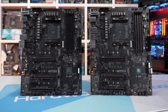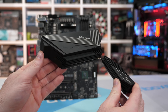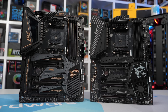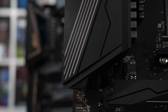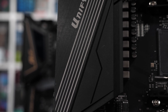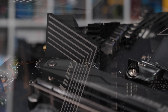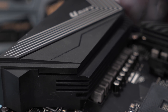The Unify is said to run even cooler than the Ace due to a much larger heatsink. Whereas the Ace features a plastic IO cover that encases quite a bit of the VRM heatsink, the IO cover on the Unify is part of the VRM heatsink itself. MSI has gotten rid of the plastic and the gold highlights, replacing them with much more tasteful silver trimmings. There's no RGB lighting at all. The only other noteworthy change is the removal of the Intel Gigabit LAN — the Unify is limited to Realtek's 2.5 Gigabit LAN controller. This is essentially the Ace with a better heatsink, no RGB lighting, and a single wired network port, and for that you save at least $50 US.